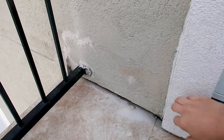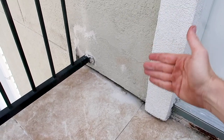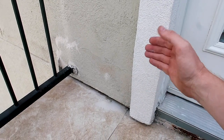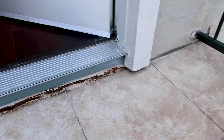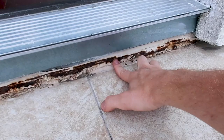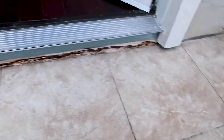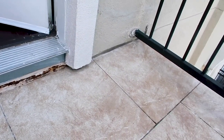One of the next signs was the cracking through the stucco right here, and you can see the bulging of the stucco. That was the next sign that the home inspector recommended the stucco inspection be completed. One of the final signs was the deck flashing starting to rust through — they've been patching it a lot with caulking around the base. You shouldn't have to caulk this flashing at all, and that was his final conclusion: you really want to get this done.